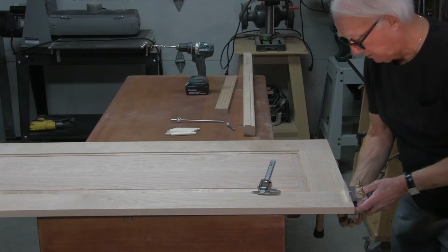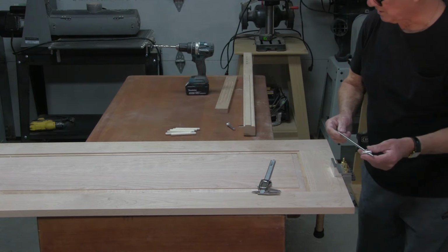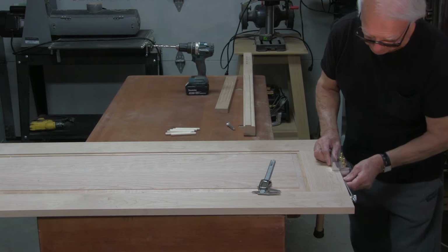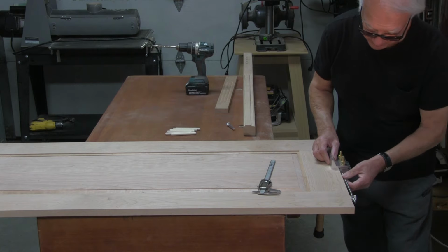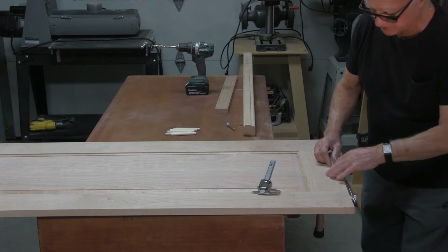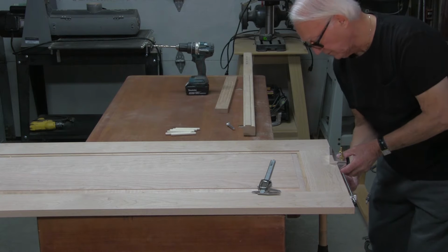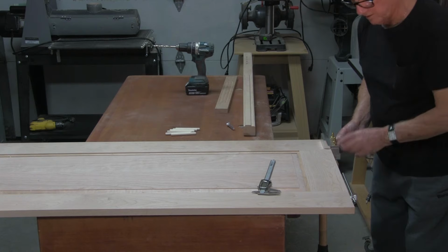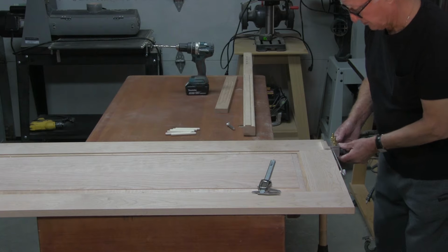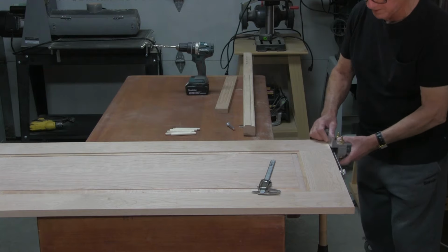Now we come down here, and this is set at 10 1/4 inches, and we set that in the last hole, and make sure it's absolutely square in all directions. Bring it up to you, and we drill through number 1, we just need 1 to keep this in good alignment. Then we move down, and we're now back in the same sort of position we were up here. So this is the same setting, and we drill through 1, 3 and 5 again. So we've got a total of 3 here, 1 there, 3 there, 7 holes.